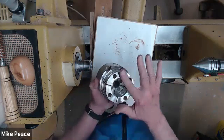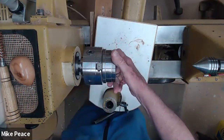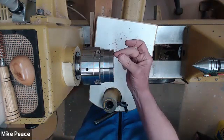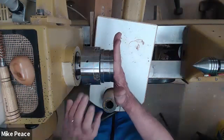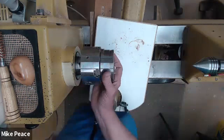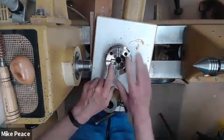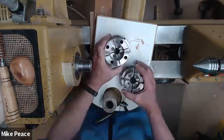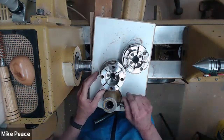But because it's got this very large face, it really holds stronger, because the strength you get from a jaw set is not from the sheer clamping power. It's the mechanical fitting of the flat area where it won't rock, and it won't rock because it's held in place by compression or expansion. And so this is a very, very strong set because the size of this face compared to their standard jaws is significant. So this could accommodate a much larger one.